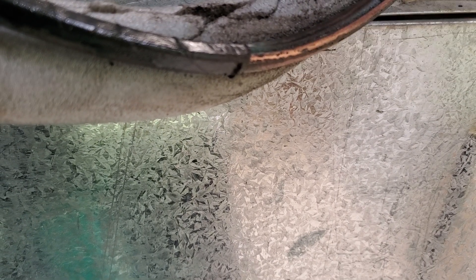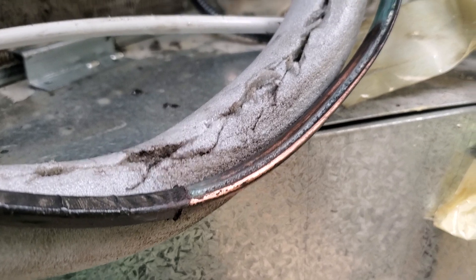If you hear that, it's actually a hole right here — that's where the hole is at, and the nitrogen is coming out. So I was able to find it. What I'm going to do now is cut out this bad piece of copper and get a whole new line set put right in here, and we should be fine. Then I'll charge it back up and everything should work fine.